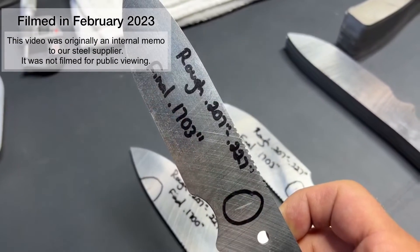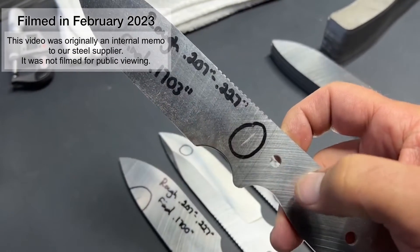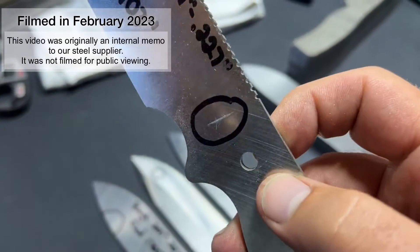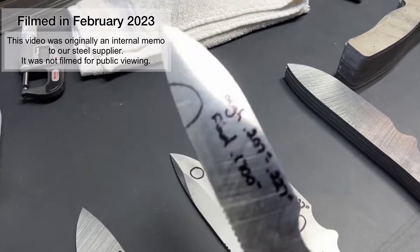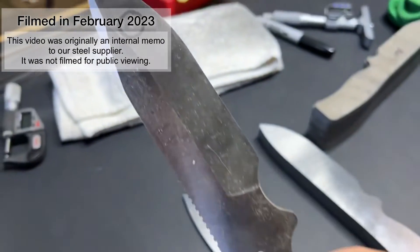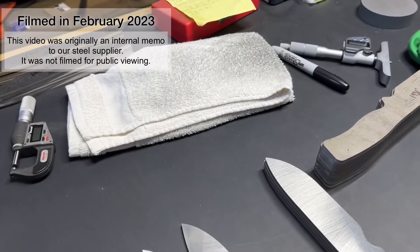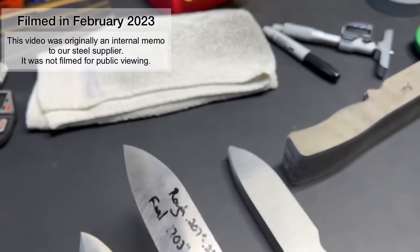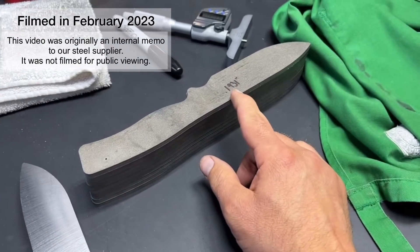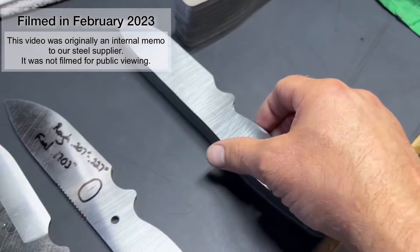I'm way down into these parts now — we're down at 170 thou overall thickness, so we've taken plenty of material off both sides to arrive at this. I've got a void down there, another void. Same situation but way down in the bevels — that's damn near the center of the sheet — another void. And now while just grinding this, I'm down at 193 in a sheet that was around 210 to 213, so I'm a good 18 thou or so into this.